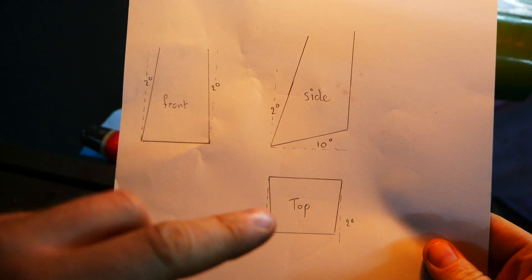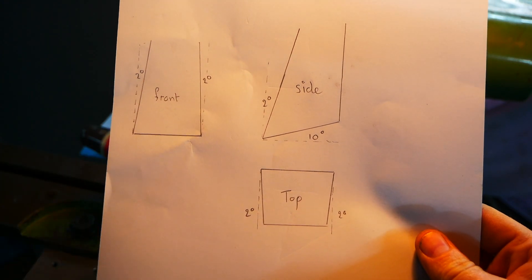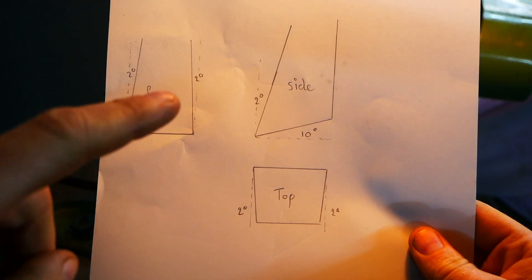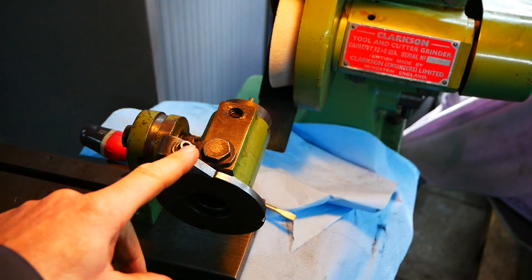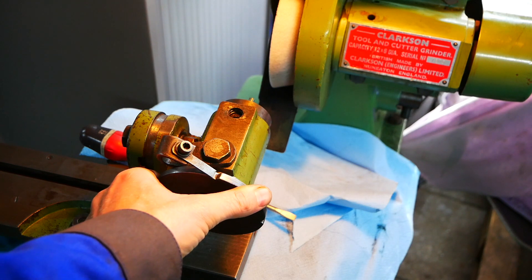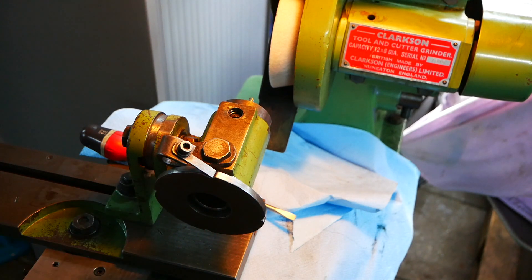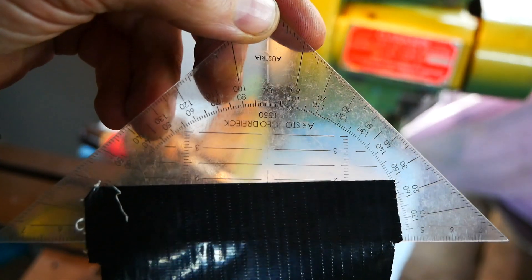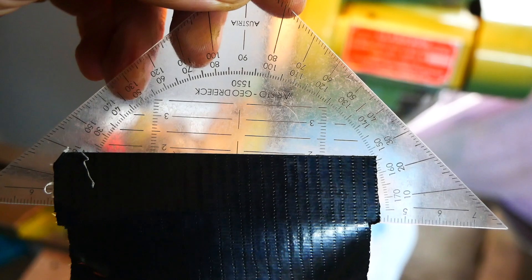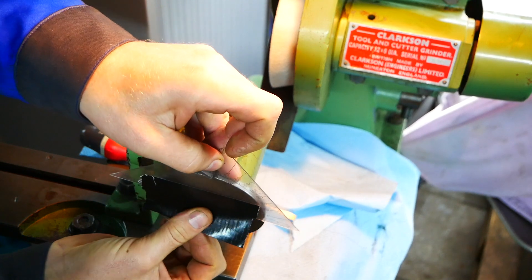For the top and the front clearance — the two degree clearance — I need both angles in one cut. So now I only cut the top side two degrees but not the front side, so I need to tilt this one in two degrees and then grind it. I thought about making an indexing head or something like that, but then I thought, okay, this project was about quick and easy. So two degrees, two and a half, one and a half — it doesn't really matter, this is close enough and it should work.